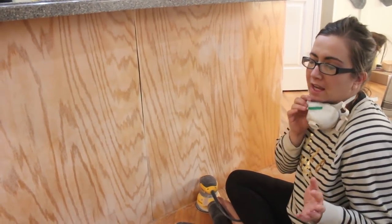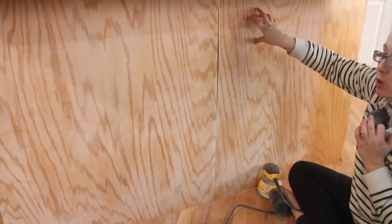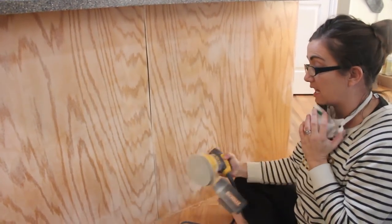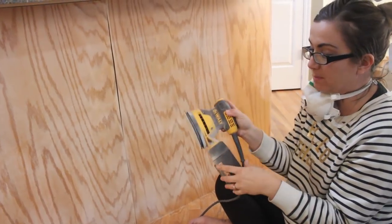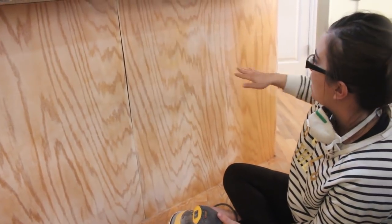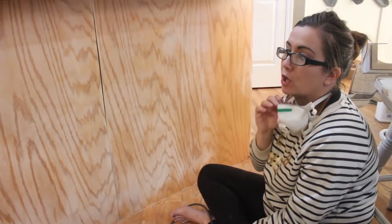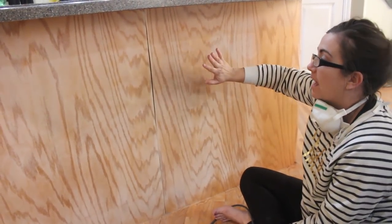This is taking a long time. I think painting and sealing will be less work than this, but prep is really important. You see me do a lot of pieces where I just clean them and lightly sand or don't sand at all — but kitchen cabinets, I don't care what product you use, I feel like they need to be super scrubbed. They also need to be sanded because they take a ton of abuse and you really want to give it the best chance possible. I scrubbed them really well with TSP, and once they dried, I'm now sanding. I've got a sanding net that controls dust. This is 120-grit on my DeWalt sander — not going to the natural wood, just taking the finish off. If you don't want to go to all this effort, you could probably just clean and prime and paint, but I'm not willing to chance it.